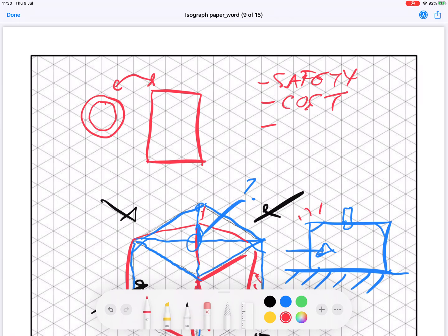Another case in point about stress is to think about stress concentrations, or the K factor. When you drill through tubular steel or timber, you weaken it effectively, because you have stress concentration points. You want to take that into consideration with the amount of material you have around your timber frames where you've placed your bolts. Another point, just looking at your video, is that your bolts seem to be way out from your timber. You really want to either use smaller bolts or try and cover them up a little bit.